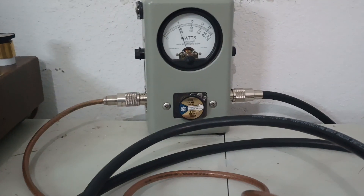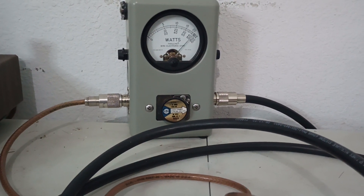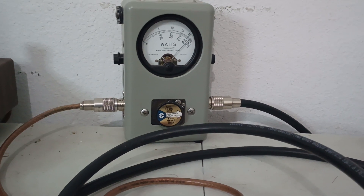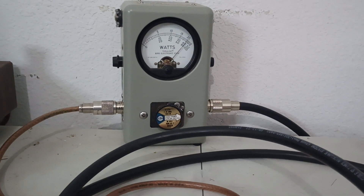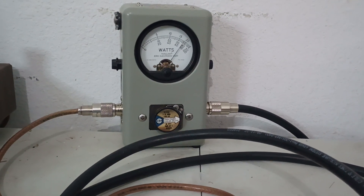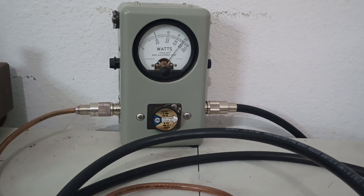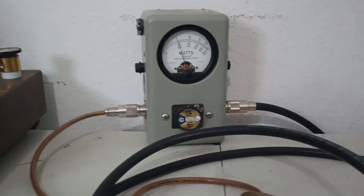PEP audio — one, two, three. It's a pretty hot 4-pill too. Audio one, two, three — about 900 watts PEP there. So doing just under 400 average and 900 PEP. And to be honest, this is how I would run it. I mean, it will take more drive, but why would you even want to put more into it? Hard to beat that. In my opinion, that's running pretty dang solid. So, 400 HD with sideband.